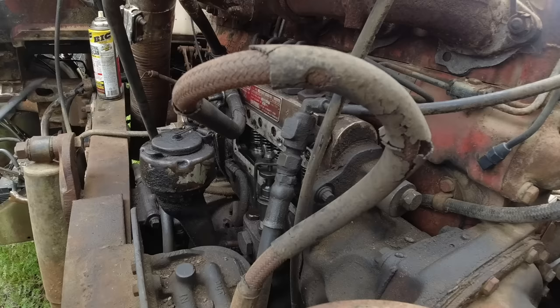What kind of motor is this? No, that's a V8, ain't it? No, it's 6-cylinder. It's an E3, wasn't it? No, E6. Is that the only mark? I think it was set. I think that is for setting the number 4 and 3 valves. Okay. We'll bump it and look for another mark. Yeah. We like to do things different. We set it on 3 and 4 top dead center. Just to see if our injector people can keep up with us. Yeah, come on. Bump it again and let's try to look for it.